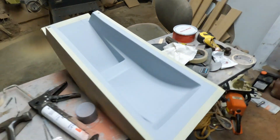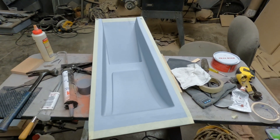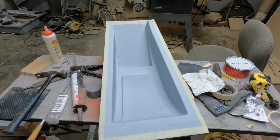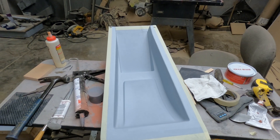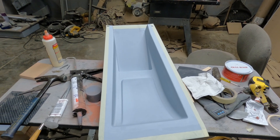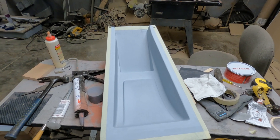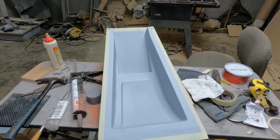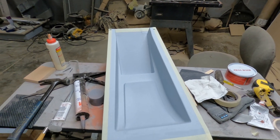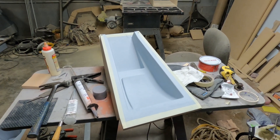In the meantime, this one is ready to go. It has five coats of wax on it. I'll put the sixth coat on here in about an hour and it will be ready to spray tomorrow afternoon. I'm going to put gel coat on this one — I like the finish of the gel coat a little better. It just seems to make a nicer, cleaner part. Although I've been told you're not really supposed to gel coat it and then clear coat on top of that, it's kind of redundant — but I'm going to try it again anyway just to see what happens. This will be ready to make a part tomorrow.